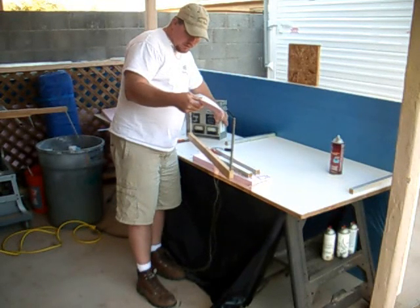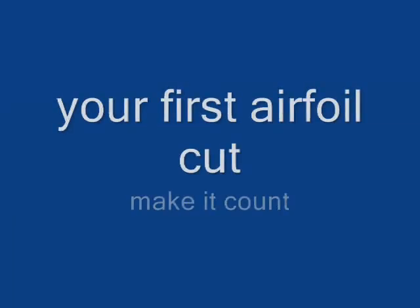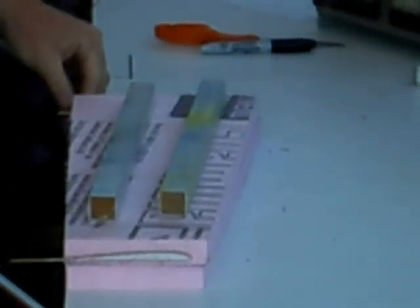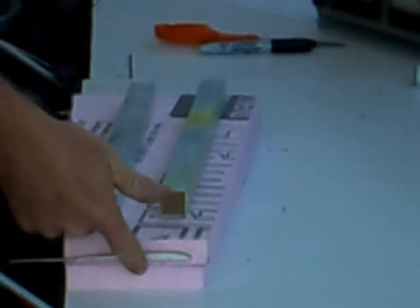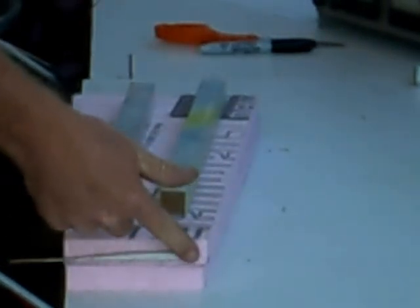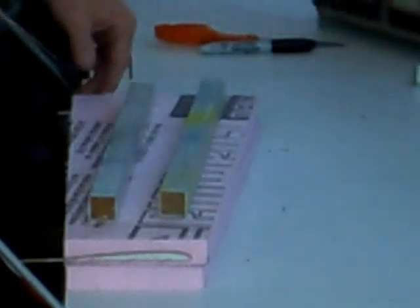I don't want it to just fall through — okay, so that's pretty good. I'm going to go ahead and set my hot wire onto the ends of each side. I do like to push on this; it would be pretty hard to keep on the bottom side of this template and keep constant pressure across the top. Right now I can keep a nice even pressure. I'm going to go ahead and turn the hot wire on and make sure your templates are all still on.